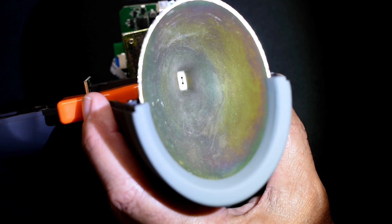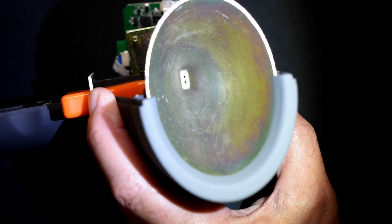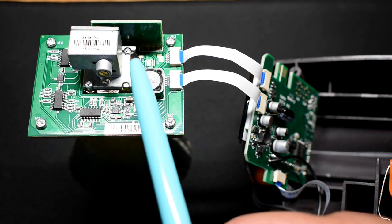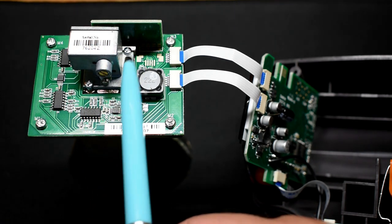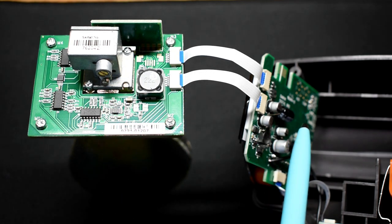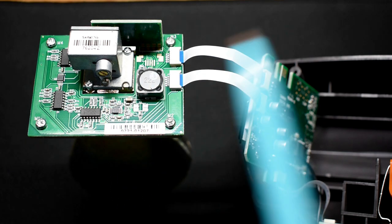If you look all the way inside the antenna to the back, you're going to see two or three little openings. That's where the electromagnetic radiation is going to be transmitted and received. Here's a look at the other side of the board with the antenna. You can see this metal box — that's where the microwaves are generated and received. Down here is an adjustment screw and another one over here. There are no potentiometers or trimmers on either of these boards, so more than likely the calibration is done with these two screws.